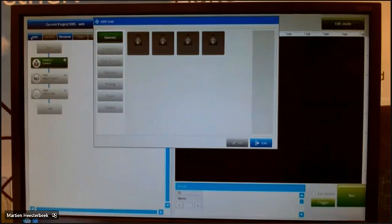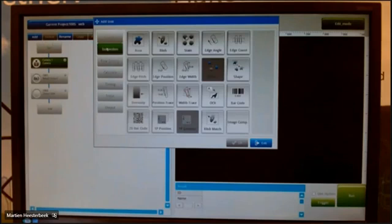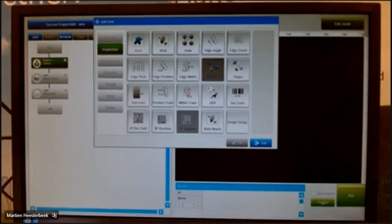If you want to add a function, an inspection, you go to add. And of course, there are a lot of inspections already there. You see, for example, area, blob, stain, edge, and so on. These two grays are not available in the firmware at this moment. One pole position is used for connecting to a robot, and in that one, you can easily set up the robot itself. I will show you how it looks, but I don't have a robot connected, so for me it's difficult to do, but I can show you how you can set it up in that case.